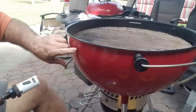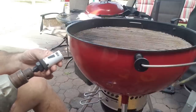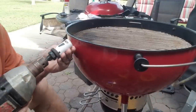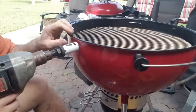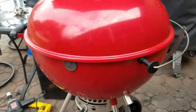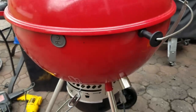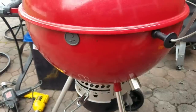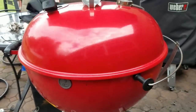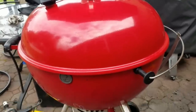Let's drill a hole. As you can see, I have my hole marked here and I've got my bit ready — this is an inch and a quarter bit. I'm going to drill this out for the grommet for my wireless thermometer. I'm going to get a little closer to the top rim. One more thing on drilling these holes: if you drill a hole in the kettle, drill from the inside out. You can't hardly drill through this porcelain enamel — that is some tough stuff. Your drill will sit on top of that forever and spin and won't dent it. So go on the inside and drill out, and it will work just fine. Start with a small drill first — do your pilot holes, maybe step up one more, and then go with the size you want to drill.